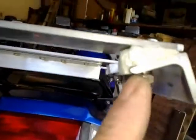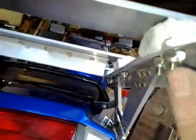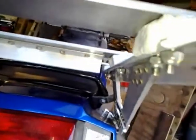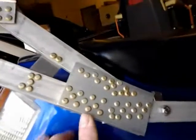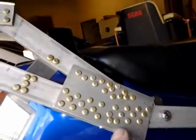I went ahead and added these lock nuts to the bottom of the 8/32 bolts. They are just loosely fitted and act as a backup in case our cut threads don't hold up. I should also mention that I put lock washers under all the main bolts as well as all the 8/32 bolts. So far, nothing has vibrated loose. Also, I used the angle grinder to grind off this little tip that sticks out, as well as the excess plate material here and here.